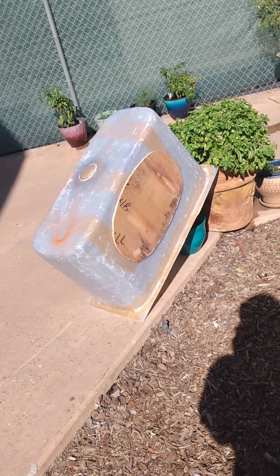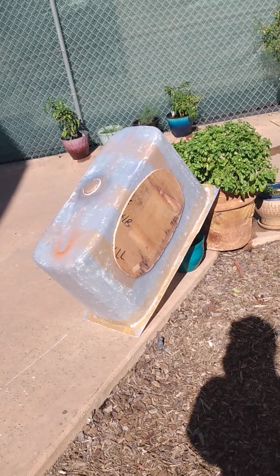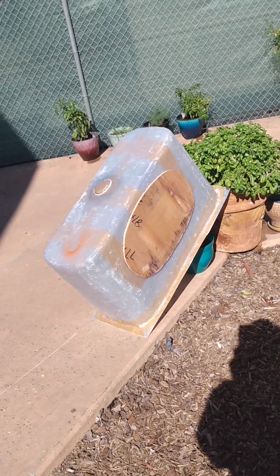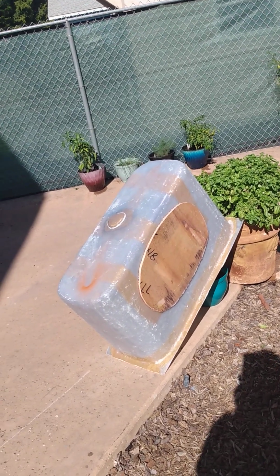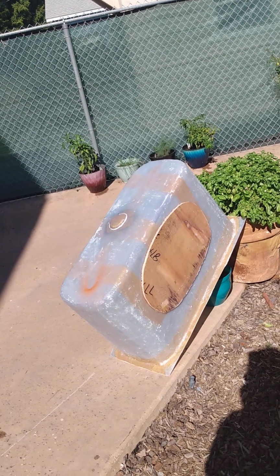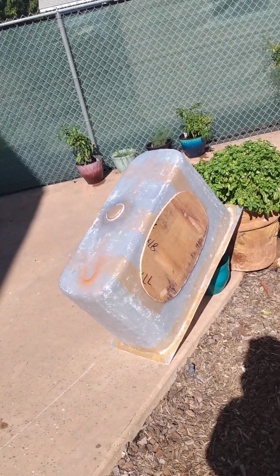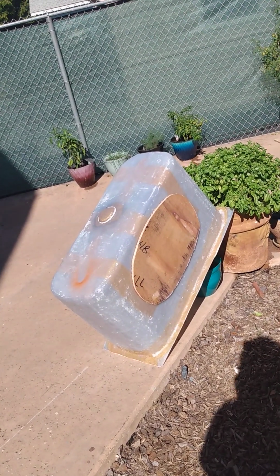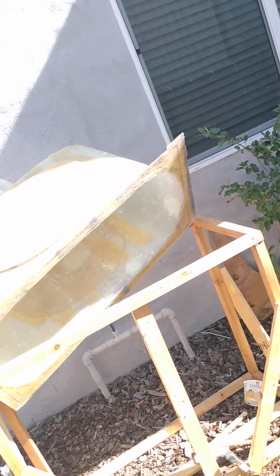4800 from Proline Paints over at Sherwin-Williams. It's a two-part, highly sought-after finish on boat parts, exterior. You can do it on this because it's not submerged in water all the time. They say don't use the 4800 if it's below the water line because it's submerged all the time. This you can use it on because this is just for temporary filling and running bait, and then it's drained and dry. So all good on that. That's no problem. It's a good application.